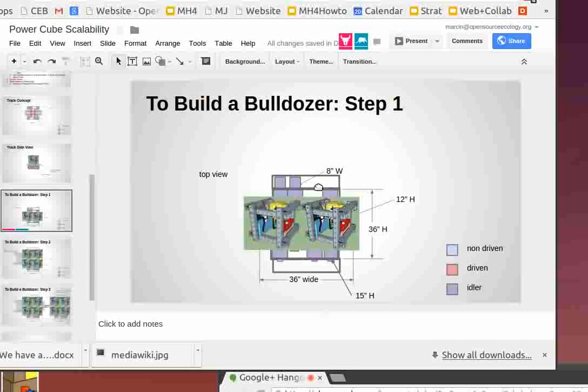Like a 10-ton, 30,000-pound machine, you're able to pull off with those types of bearings, which nobody does because nobody designs machines like this. The industry standard is to put a lot of money into proper tapered bearings, which are required for huge forces, like with Cat D5 bulldozers. Here we get away with the force requirements by articulated steering primarily, and by keeping the width between the tracks higher compared to the length of the tracks. So we're able to do a lot with very simple parts. We don't know this yet, we haven't done it, but it looks great on paper.